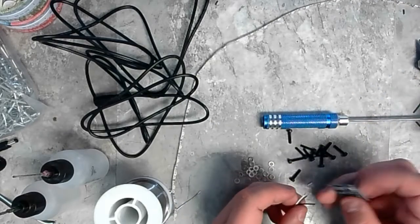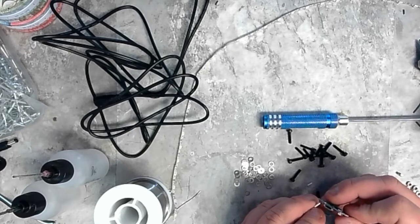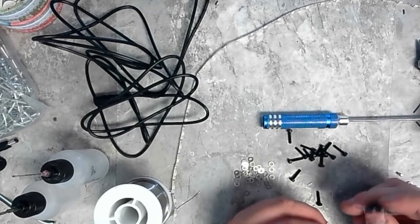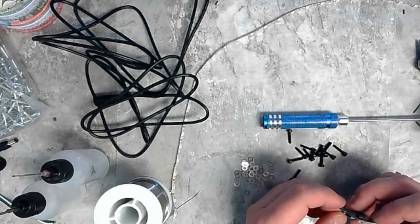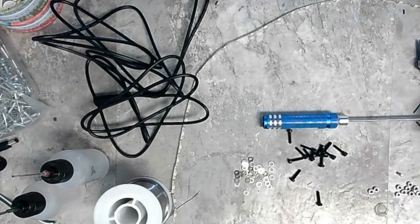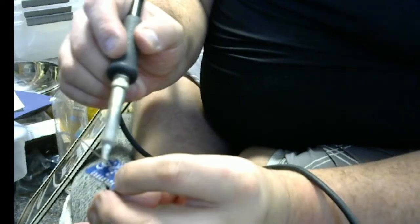Okay. So what do we got here? We got ground. So I guess I need to put that over here. And I'm also not using a resistor, and that's on purpose with this. I know technically with NeoPixel strips you're supposed to, but with a 3.3 volt line, I haven't seen any issues yet with not using a resistor. So I'm going to press my luck yet again. There we go. Got that through. Okay. Let's dangle this, and I think we can go to lap cam for this. Maybe. Oh, there we go. Try to keep you guys updated with all the action.